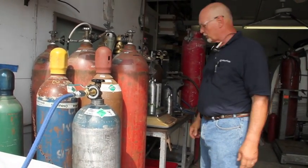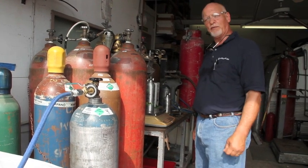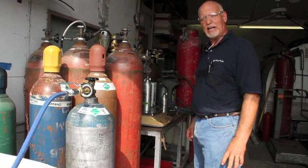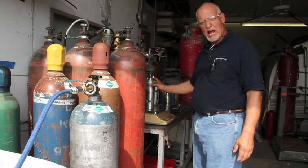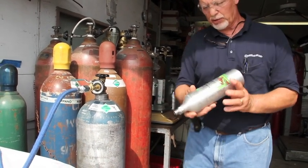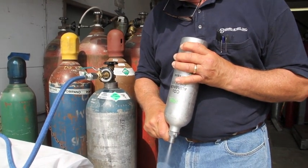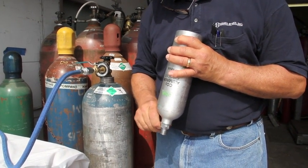We got that very well chilled this time. We actually have a full weight of 3.70 pounds, which is more than an ounce overweight. If that happens, you take the cylinder and turn it upside down, hold it firmly, crack the valve, and bleed a little bit out.